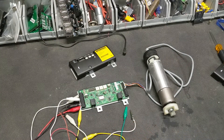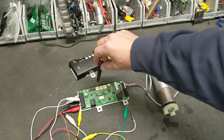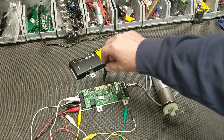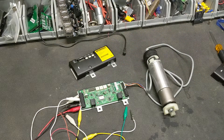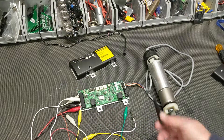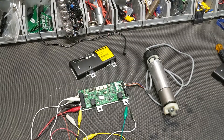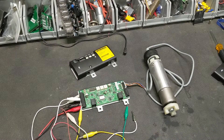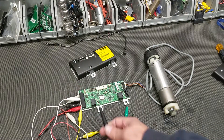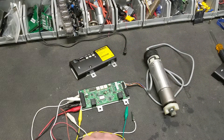This is a hybrid controller, which means you can actually make changes using dip switches or these little pots on the board, or you can make changes from inputs on these different pins. It's really versatile. If you want to control it by an Arduino, you can do that. If you don't feel like doing the programming, you can just set your switches and go with it.